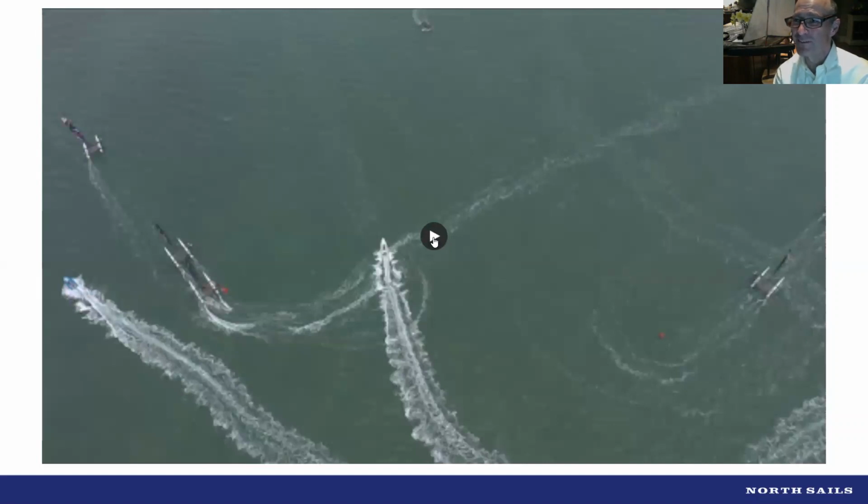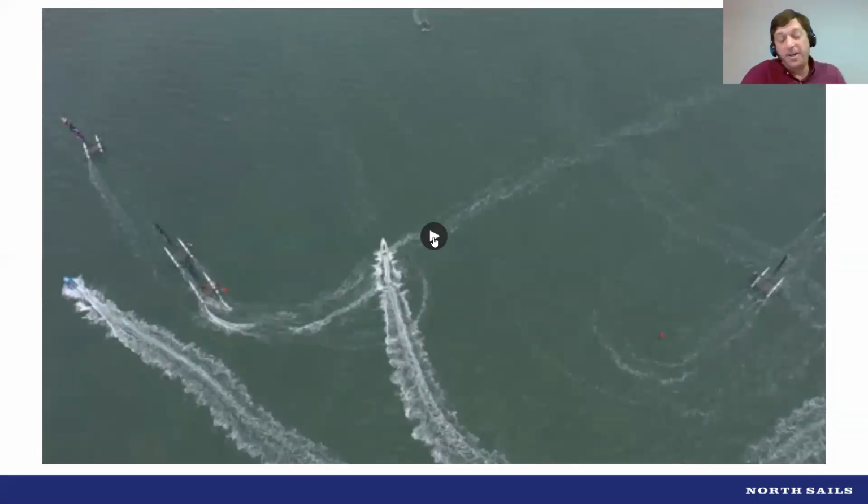And practically, what do you do, Stan? Just like you said, the boat slows down as the gennaker is getting furled or doused. The sails have got to go way out. And then when you're rounding the leeward mark, they've got to come right back in again. So it's a really athletic move for the crew. You've got to have all hands on deck getting the sails back in, because as soon as you've rounded the leeward mark, you're accelerating again, but it's really hard to get the sails in fast enough for how far they've been out.